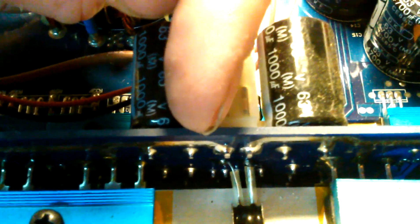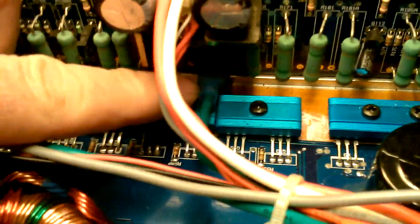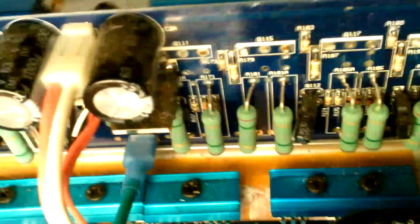This should not be removable — it should be soldered directly in. You have a high voltage rail; it should go directly to the board. These connectors tell me this is a quick-repair design. Down here there's a little spade plug bent up and pushed into the board, stressing it. There's another spade connector at the bottom — shouldn't be like that. Audio Bond gets these back so often that they just unplug the board, replace it, and send it back to the customer.